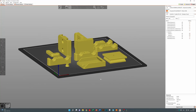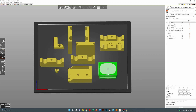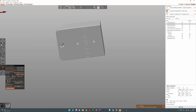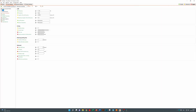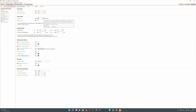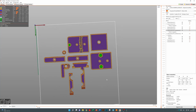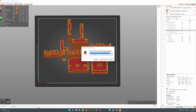These are the building pieces of my design. First, let's make sure they are placed and arranged correctly on the print bed. Second, paint on supports where needed. Then set the infill density to 25% and the perimeter walls to 4, and don't forget to deactivate auto supports. Check the print and the supports before sending it to the printer, and off we go.